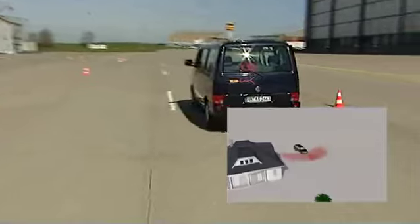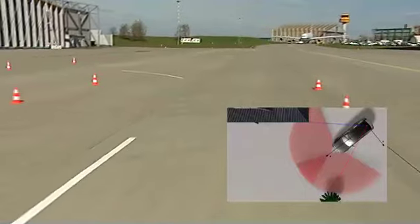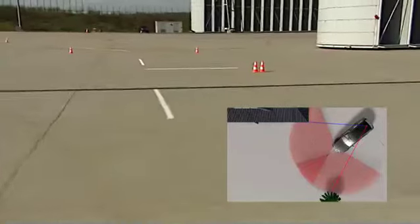Team Lux uses a novel approach to navigation. For positioning, we use a high-precision Omnistar GPS receiver. We don't need an inertial measurement unit. Instead, the laser scanner is used to track features such as trees, corners, and poles.